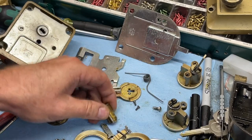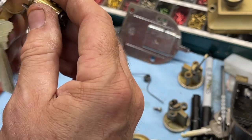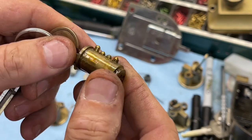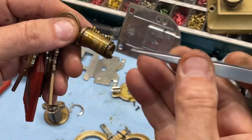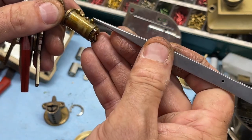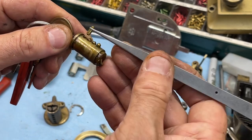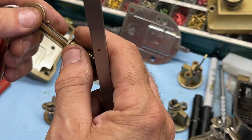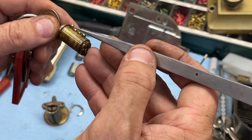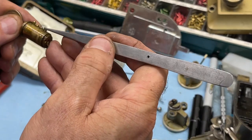Here's one reason why Yale locks are sometimes pretty easy to pick. Look at those pins — original pins, they're not upside down. They are that way on both sides. That makes these guys a lot easier to pick if you have to pick an original Yale with these pins, because of the shear line having ramps basically. For this one, let's go ahead and code cut a key for it. We're going to use some space and depth keys to decode it quick.